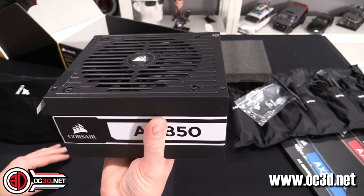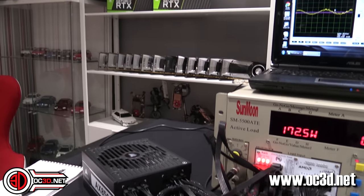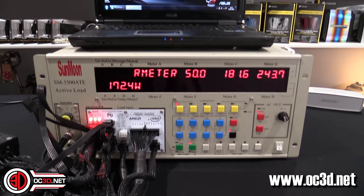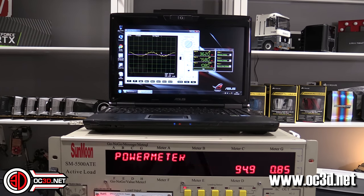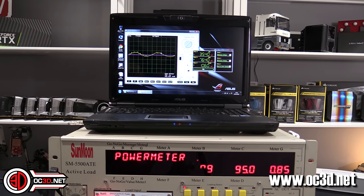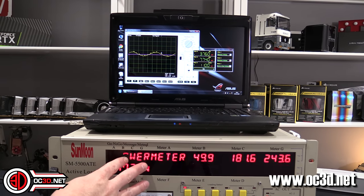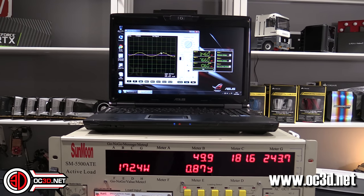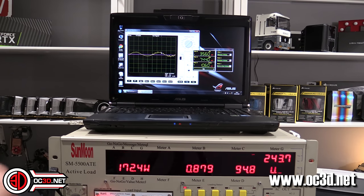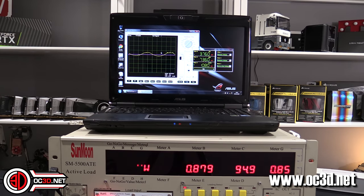Now I've got a load tester, so it's time to get it set up and start torturing this poor little power supply. Straight into the torture testing - I have the power supply set up on the load tester. I've put a manual focus on, and I can't do anything about the flickering here - it's just because it's an LED panel and the refresh rate is slightly different to the camera. We have a couple of numbers to keep an eye on: this is the amount of watts being pulled from the power supply itself, and this is the number actually being pulled from the wall. So you're pulling 172.5 watts from the power supply at 94.8% efficiency, which means we're pulling 181.6 watts from the wall.